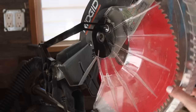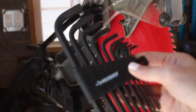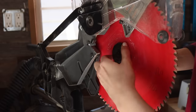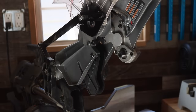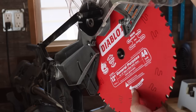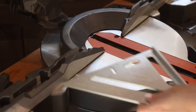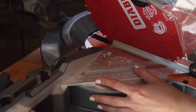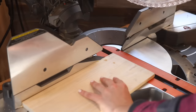Since we're focusing on my miter station, I get a lot of questions about how often I square my tools up or when I change my blades out. As you can see the blade here was really really dull, so I did change it out with a brand new 12-inch Diablo blade since it is a 12-inch sliding miter saw. Having that mechanic set from my last video laying around the shop makes this so easy because it comes with literally every accessory you need for any job. I like buying all my saw blades in multi-packs because it leaves me one extra in case I need to change something out. I always keep a general purpose blade and also a finer cutting blade depending on the project. I also adjust my fence and check for square pretty regularly to make sure my saw is cutting properly.